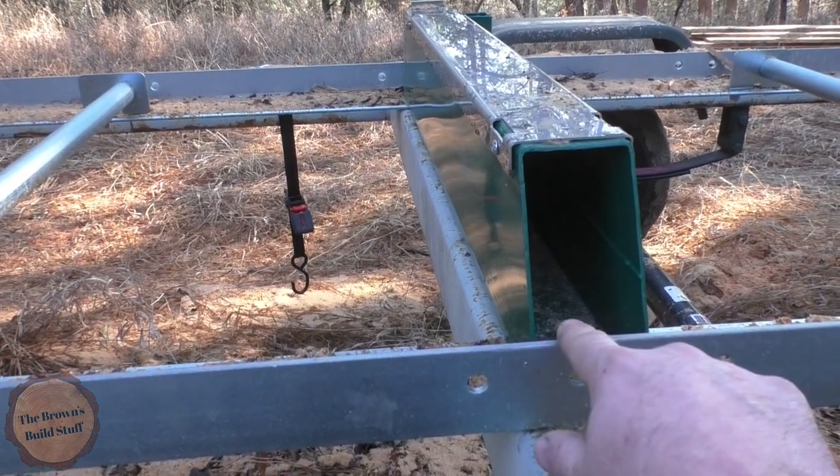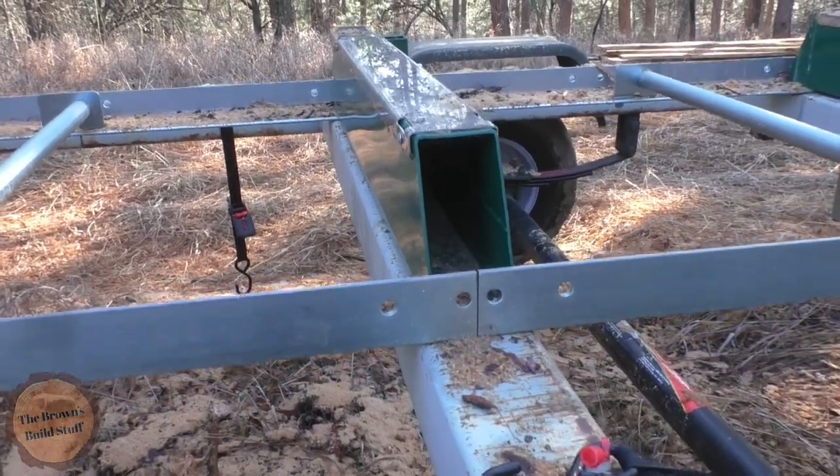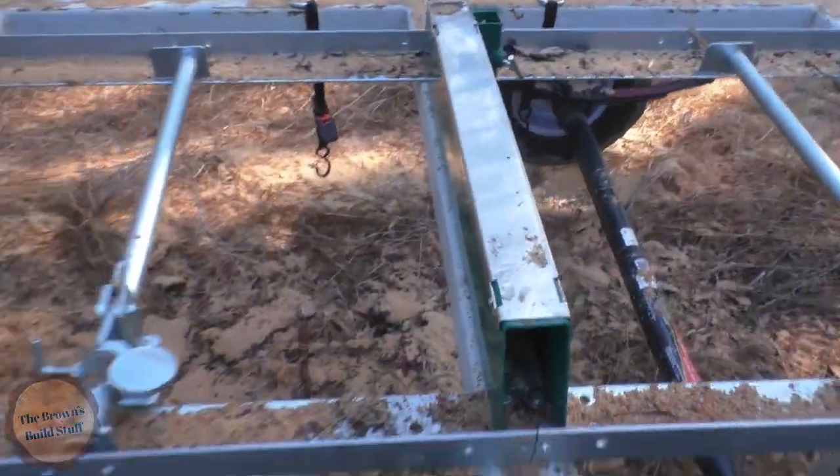So you'd probably get used to it, but at the same time, I'm gonna smooth mine out. Problem with doing that is it is going to rust there after you do that because you'll be through the zinc. I'm gonna go ahead and sacrifice it because I just want it to be smooth just so I don't think I'm screwing something up.